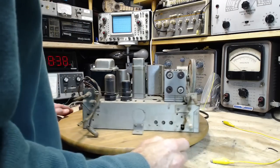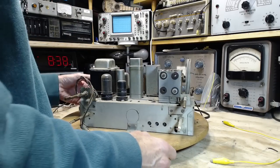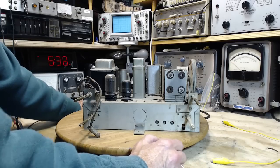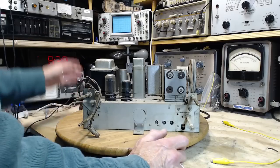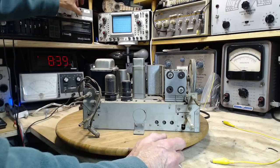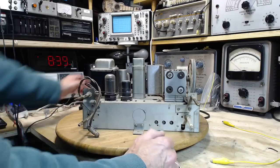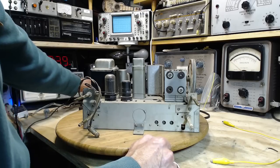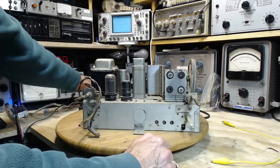Okay, so not to panic. I should have read the power consumption on the watt meter here while the radio was operating. So I'm going to turn it back on, and it's not going to heat up that much more. And we'll measure the wattage, the watt drain on here. It's 108 watts right now. 110, 112.